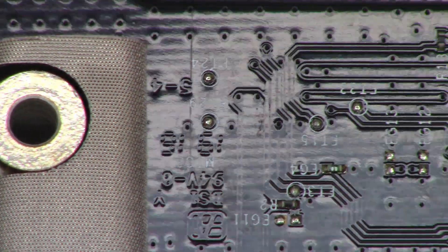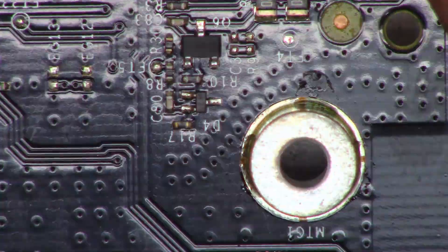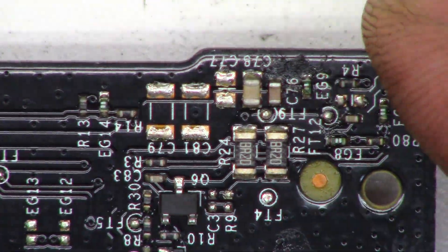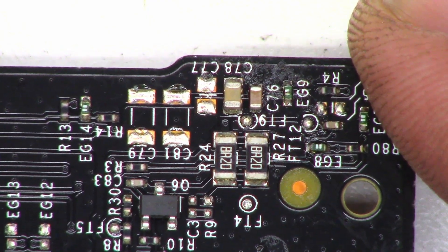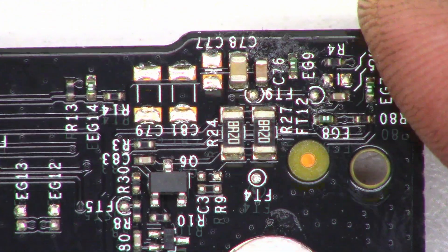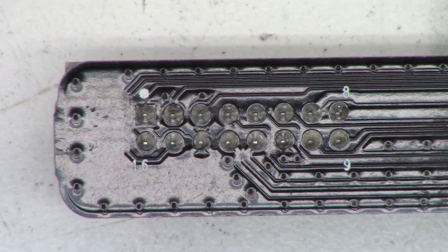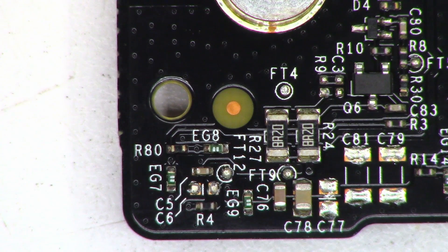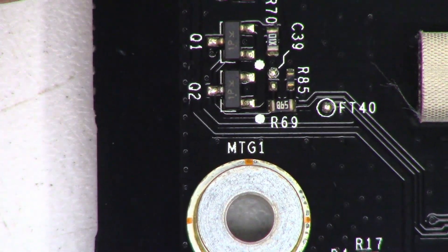I was just going to try to loosely assemble this thing on the bench and see what it did, but I think before I do that — there's some more crud right there. All of the components seem to look pretty good except for right down there. There's some crud on EG9. I'm going to go ahead and clean it off because EG7 doesn't have it and EG9 does. There's the connector all nice and cleaned up — all the shmoo washed away. There's EG9 all cleaned up. There was a bunch of shmoo on it before, all gone. Looks very, very much better. I don't see any defects on this board at all.